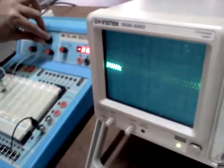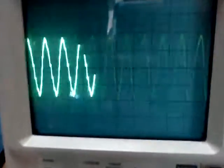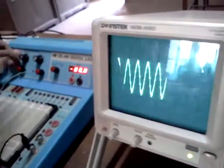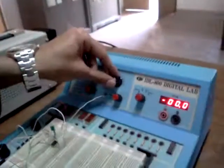You can see the wave shape is changing. If we increase the frequency, you can see the high pass section is getting better — this is the saturation point. If we increase it more, the output amplitude will drop. So if we increase the frequency further, the output amplitude will keep dropping.